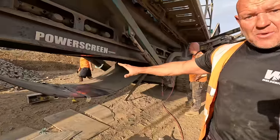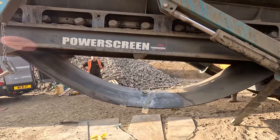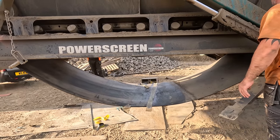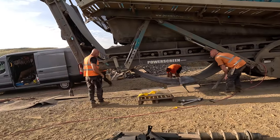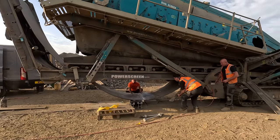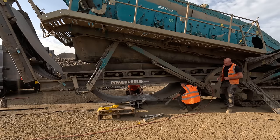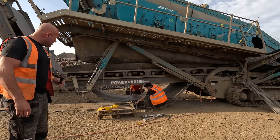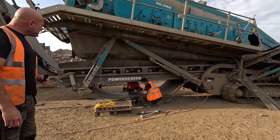That slack in the belt. Right, now we can get the press in it. I'll turn the heat down a bit, Bob. How we went, Bob? Yeah, that'll do. I'll put them on, Bob. Once this press is on, it will be on for a good hour, once it heats the belt up and sticks it together. Bob, what are we saying, an hour? Yeah, maybe about an hour.